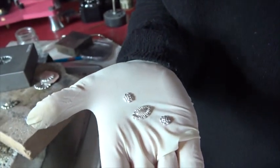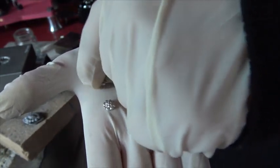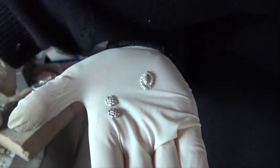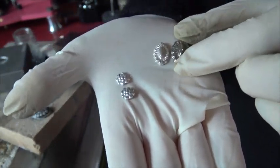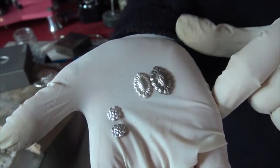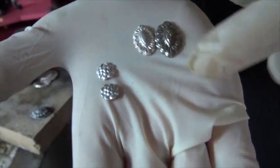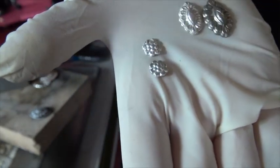I make lots of things — little flowers — and this is one that I made. I just torch fired them. You can even use a butane torch if you want; just be careful not to melt them. They shrink a crazy amount — about 30% shrinkage. So this is the size you get if you use the press, and this is the size you get if you use the PMC3. The press result is also just much nicer.